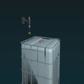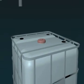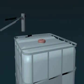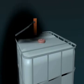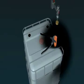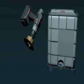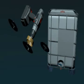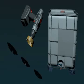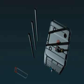Take a 3-inch hole saw and drill three holes in the top of the tank as shown. If you're in a place with no electricity and no power drill, take a piece of metal pipe with a 3-inch diameter, heat it up, and melt the holes through the plastic. We did this in the Dominican Republic with a 3-inch metal sink strainer. 3 inches is 76 millimeters for those doing metric — this is the diameter of the outer flange of the 2-inch uniseals we use. Get yourself three 2-inch uniseals, grease them up with plumber's silicone, and pop them into the holes.